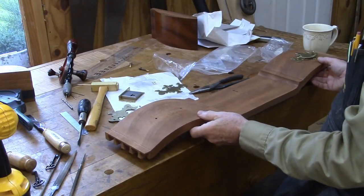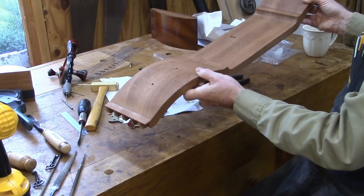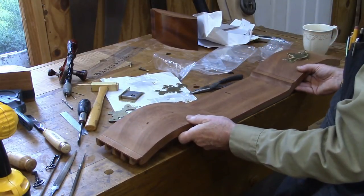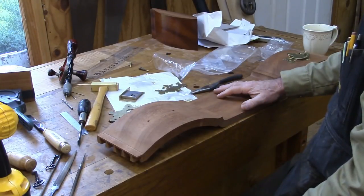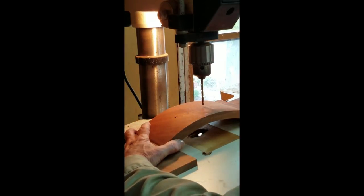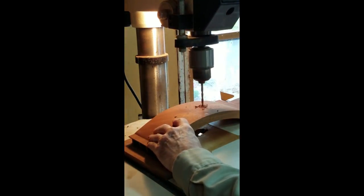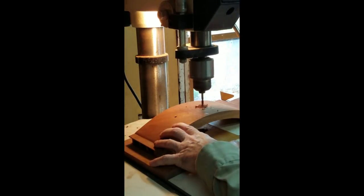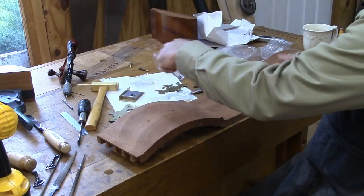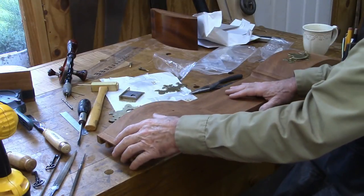I have a brief video that shows how I drilled these out — by setting the drill press table to 9 degrees, which made the drill perpendicular to the curve, and then I drilled the two holes. I'm drilling the curved drawer fronts at a 9-degree angle for the bails. You can also see a detailed video on how to drill those out from the last time I made this.